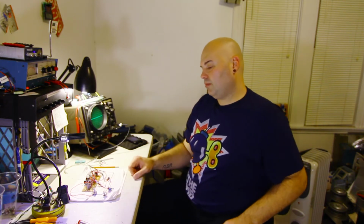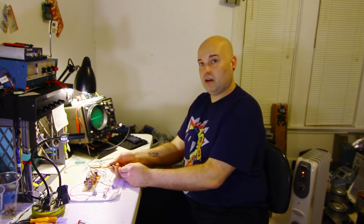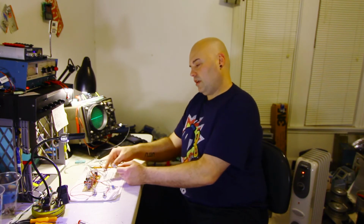So this unit is being designed with some old school ways and means in mind. The switches are the same thing. They're just regular switches that are bolted in through the side of the box. If this is mounted on a cheap PC board, and somebody's able to move it around or damage it, it's just poking through the hole, which I've seen, and it gets sheared off, it may damage the board as well. Old school has a place, man, it really does.